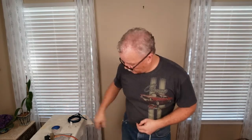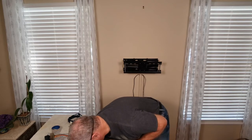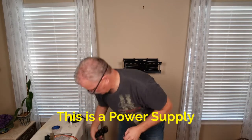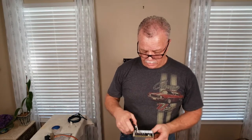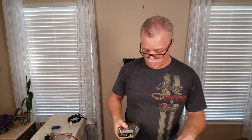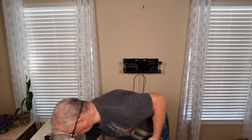If I had the other type of controller, then I would plug this in and plug a positive and negative wire to this — give it a little short pigtail — and be able to touch these wires. That's how I can test it with a power supply like that.